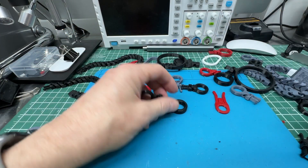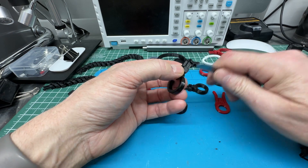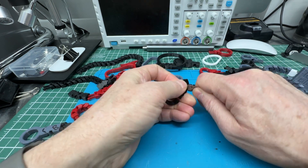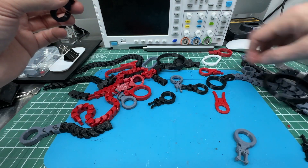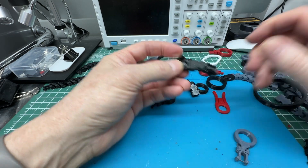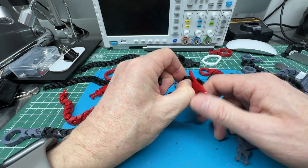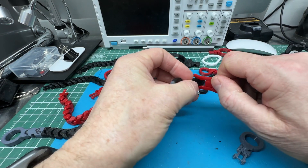Let me show you a close-up of a couple of the pieces. Number one is the support — there's a tiny little piece of support needed on the male side of the clasp. It comes off real easy; you can just pinch it, but I find if you go in the back side with a scalpel and twist it, that pops right off. Once you put parts together, my original idea was to just pinch in and release the barbs from the female side of the clasp, but that was very difficult because it's too small. So I made this key — you just slide the key on and they pull apart. Remove the key and you can reassemble it as many times as you want.